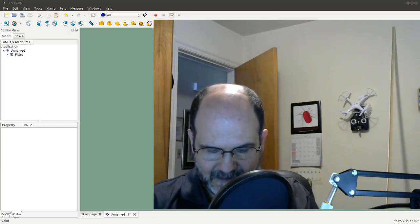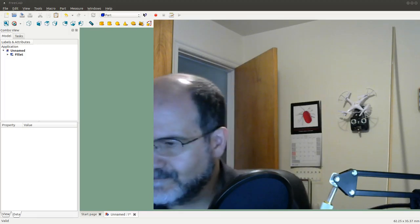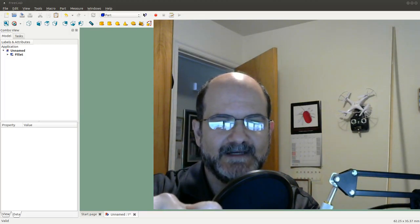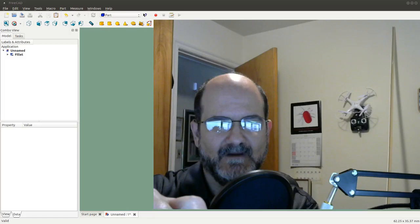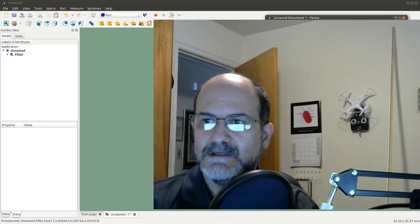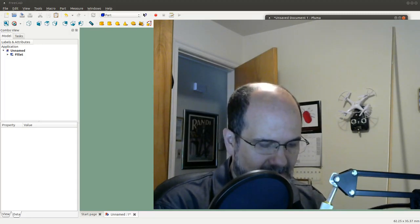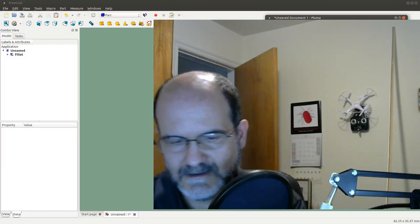So, first thing I'm going to have to do is take these command strips, just grab one of them and do my measurements. So, caliper, and what do we got here? About 15.5, so it's got to be a minimum of 15.5, so let's take it, for safety, make it 18 wide. So the command strip is 18 millimeter width.